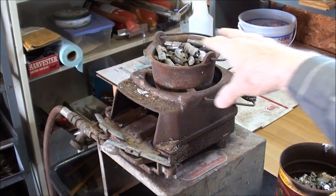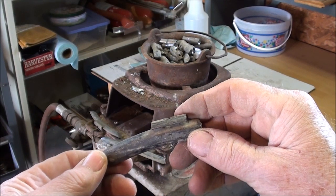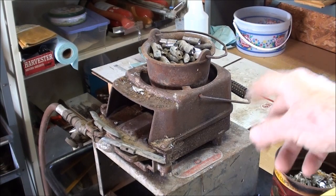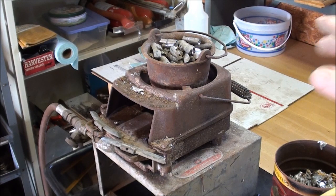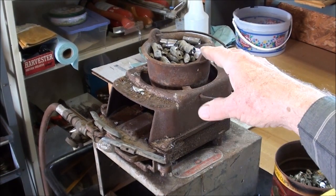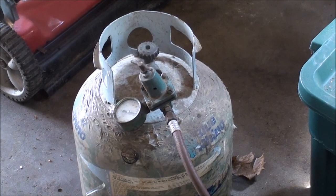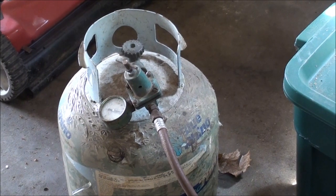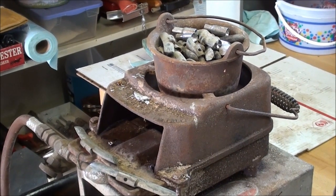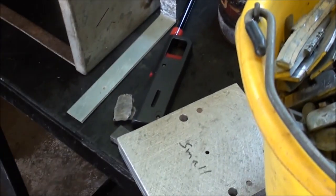Here's my little plumber's furnace — I already got that charged. The steel clips from the wheel weights will float to the top; yes, steel floats in lead. I'll skim those off. That'll take about 15 minutes to come up to heat, and I'll add more lead. I generally keep a couple pieces on the hearth to preheat so when I put them in there it won't be a problem. I add lead constantly every few flywheels — that chills the metal so it doesn't get too hot. I'm working on my portable welding cart here, made of steel.